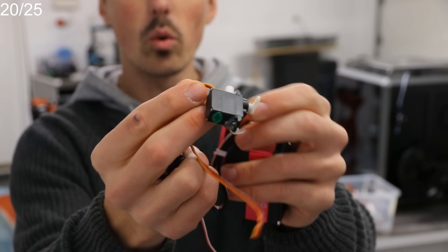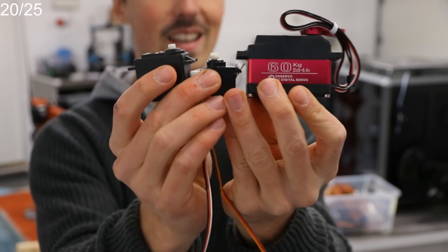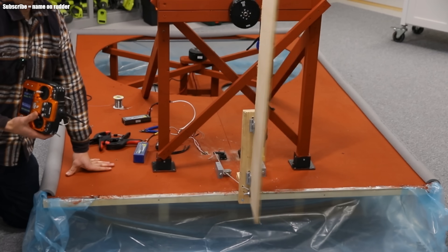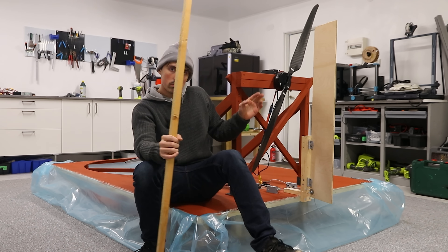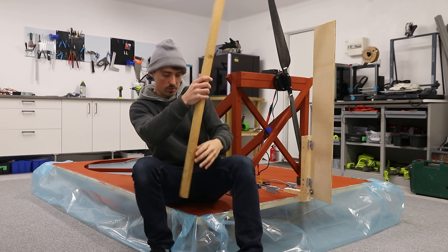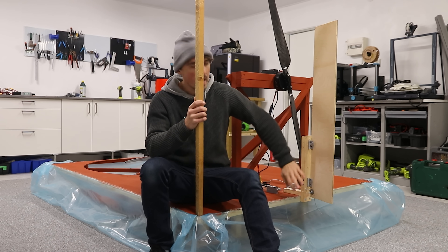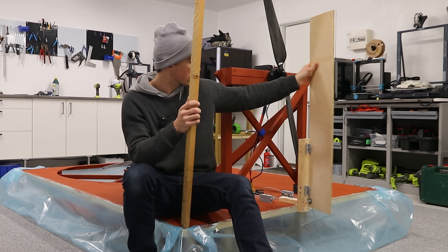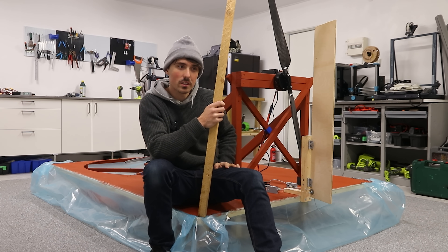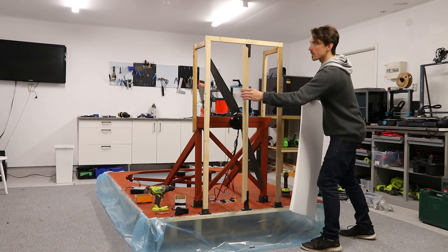We're using a mid-sized RC airplane servo. I then assembled the rudder out of plywood and some steel wire but it just did not work — we're going to have to redesign it. The answer lies in having a cage that lets us connect the top and bottom of the rudder to make it much more rigid. So we built the cage — it adds weight but the end result is worth it. The rudder is now much more fixed in place with 3D printed parts that let it pivot.